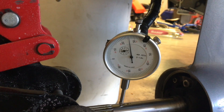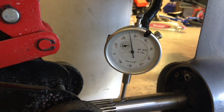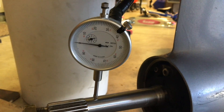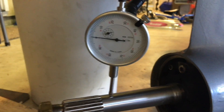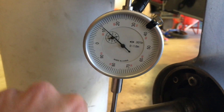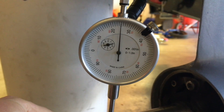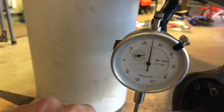We've literally gone halfway — we're halfway there now. I pulled this off to see how it's actually turning. I had to loosen up the crown a little more so I could calibrate it. I've zeroed it out and now let's see how we're doing. The high point is 25 thousandths and I'm exactly on the same mark as before — so 25 thousandths confirmed.